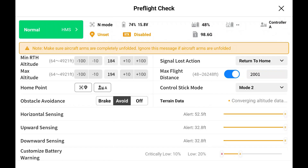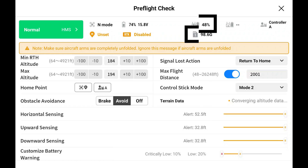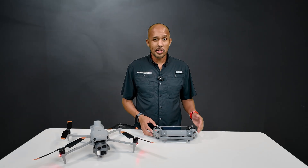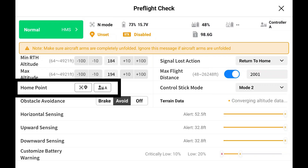Going into the camera view, we get a pre-flight check where you'll see your battery and controller percentage up top along with the space left on the memory card. You'll also get home point info and RTK info here. For the altitude, you'll want to make sure your minimum return-to-home altitude clears any obstacles, and make sure your max altitude is below 400 feet or below any airspace restrictions where you're flying. You can also set your drone and controller home point by pressing these two buttons.